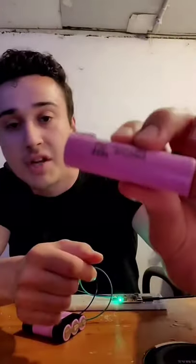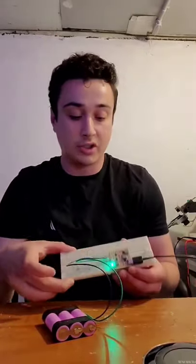So I'm going to create a test with this new boost board to test its true potential and see what this thing can really do. I have three of these 18650 battery packs here from Samsung. Each one provides 3.5 amps, and these are high drain batteries — you always want to make sure when using these boost boards that you have high drain batteries, otherwise you risk overheating your batteries. I have three of these soldered together in parallel, giving me a total of 3.7 volts at 10.5 amps. With this new charging board in place, I have it set to 6 amps output at 5.2 volts. I'm going to plug this into Podair and run it at full speed.